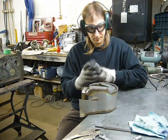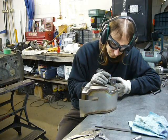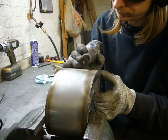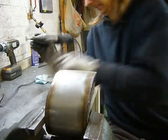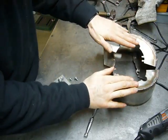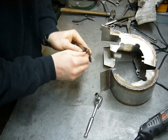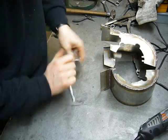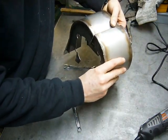This is gonna hurt. With the heat shield sliced as one would the cheapest of hookers, there has to be a way to reattach the sides together. So what I'm doing is welding some nuts to the bottom of this plate, which will become a flange that will sit somewhere here to allow the other side to bolt back on.